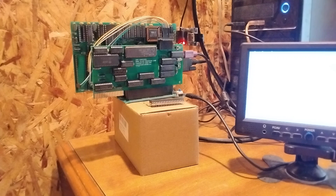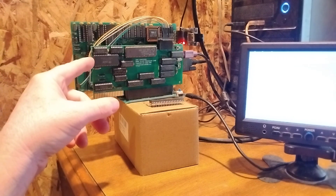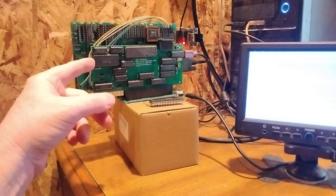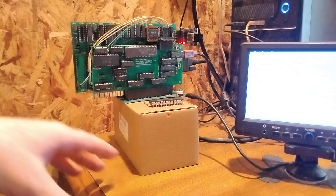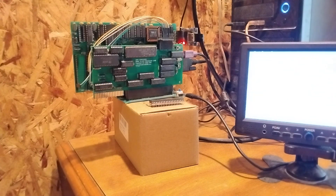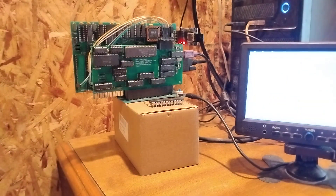Some of the differences I'd still like to have: the bus controller having its own independent clock. When it was on the breadboard I experimented with that and it does work, but not always — it seems to run more stable when it's synced with the processor clock, and I can understand why. Anyway, that's the update — thanks for checking out the video today.